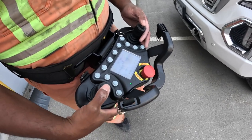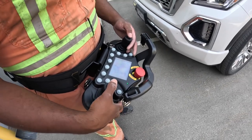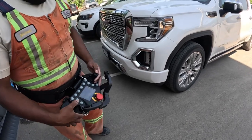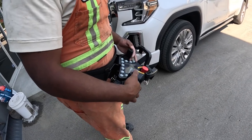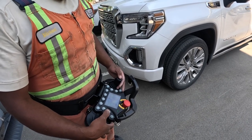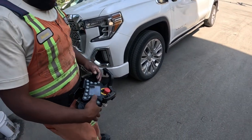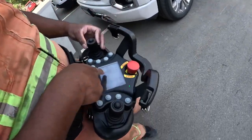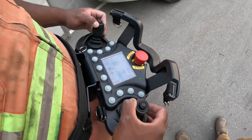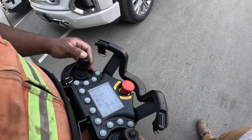I'm going to turn your volume up. Because this one's plumbed on the piston side, you really got to crank that number up. If you go straight to forward and reverse, it just stops the pump. I'd ask them about that and they had a good point — it's a bad idea, because if you're in reverse and you bump the forward stick and the pump went straight to forward pump, it wouldn't be a good thing. It's pretty cool — it shows you what it's doing right on the screen. So it's nice because the screen shows you everything, but you don't have any of those silly selector knobs where you're toggling through menus. It's all done with fixed buttons.